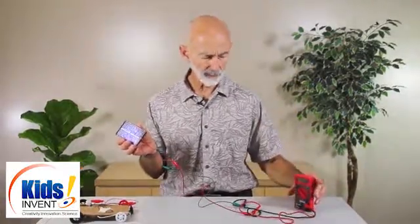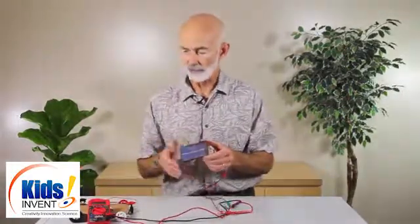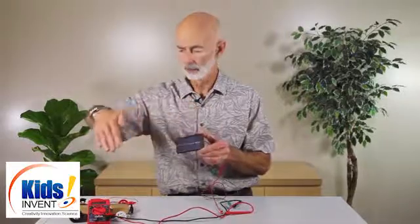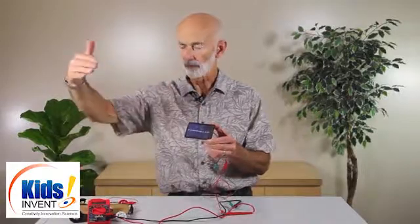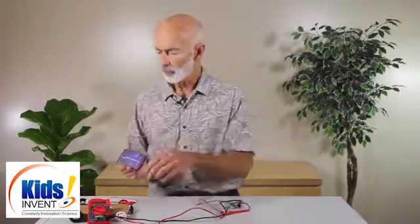And it's interesting to play around with this just to see what happens. As a cloud moves overhead, or if you blank out all the light, down the voltage goes. So solar power still works on cloudy days, but if it's really dark at the end of the day, it doesn't work at all. What you also notice is that we're operating at a much lower voltage than we did when we made our cars before.